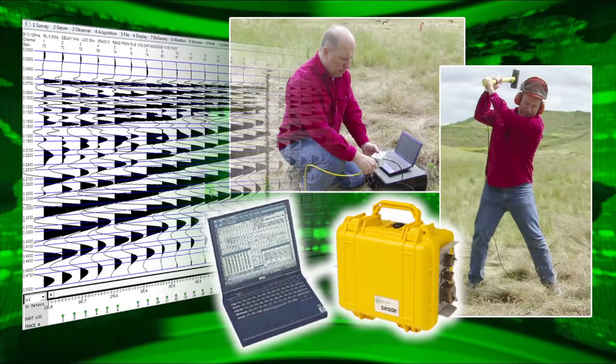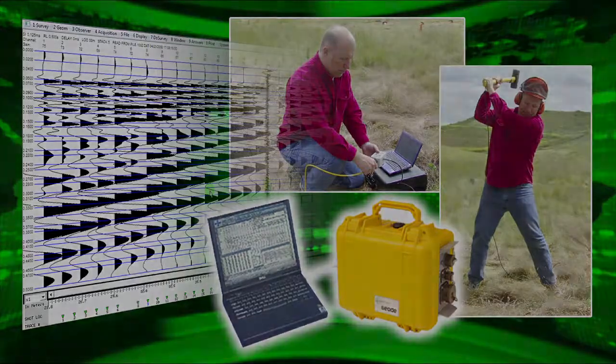This presentation shows how to lay out a set of geophones and connect up a geode seismograph to make a simple seismic refraction survey. Best practice in seismic surveying states that geophone positions should be accurately surveyed in for both X and Y locations and, if topographic corrections are required, elevations as well. For brevity in this presentation, it is assumed that this step is completed.